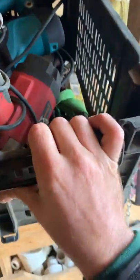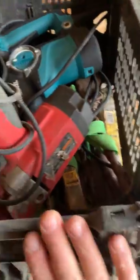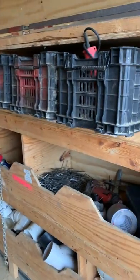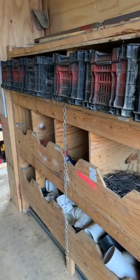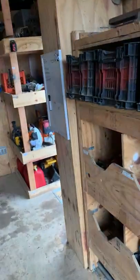Then we've got a drill box — SDS Plus bits, a big electric drill, a bunch of bits — just for large drilling and concrete drilling. We also have an SDS Max drill but we don't keep that in this trailer yet because we just don't use it enough to justify keeping it in here. We try to keep this trailer bare minimum — if it's something we're only going to use once every couple months, it doesn't need to be here.